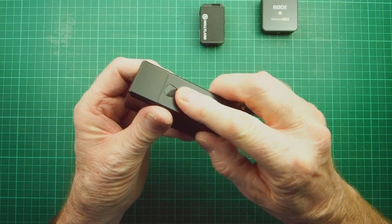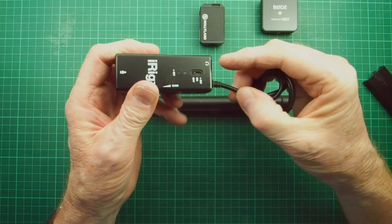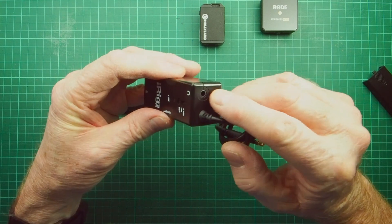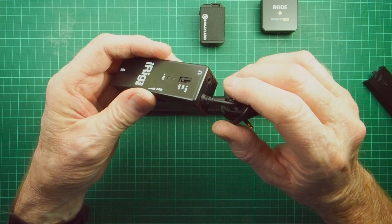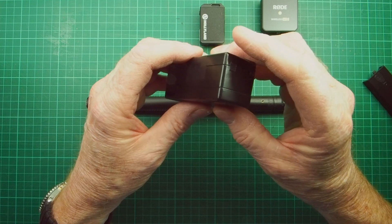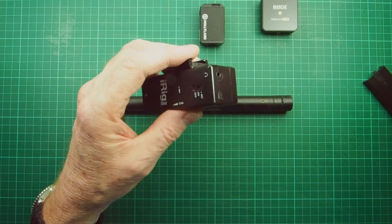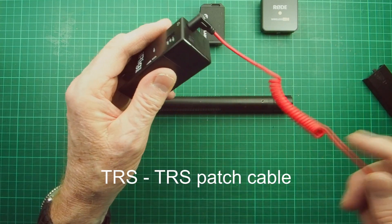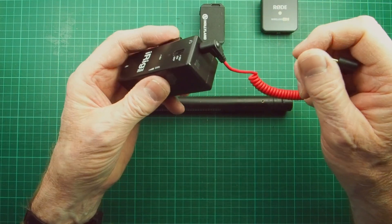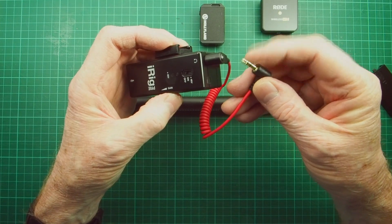I did find someone who has adapted one of these units quite easily - it's a fairly simple modification. Inside the battery cover there's a small screw you remove, and you literally cut a wire off and solder three wires together. I'll leave a link in the description for the exact details. There's also a 3.5mm connection used for monitoring audio, so once the cable is removed you've got a way of getting audio out. On the unit I've already adapted, I've blocked off where the cable used to come out, leaving just the 3.5mm connection. Crucially, I've measured this - there's no voltage leaking out, switch on or switch off. It all works swimmingly well.